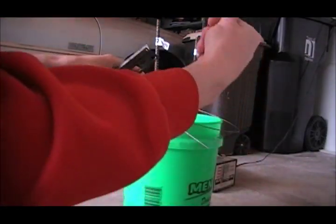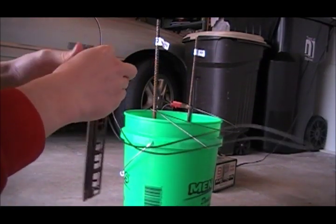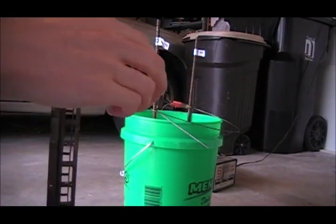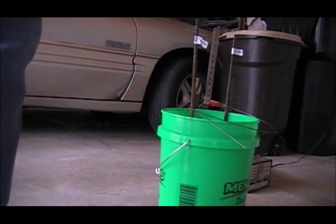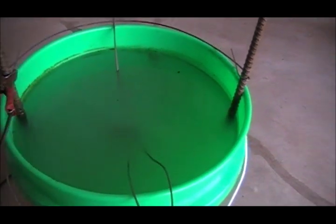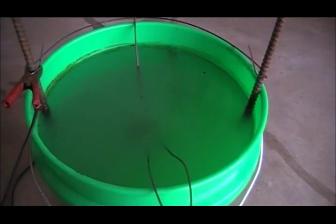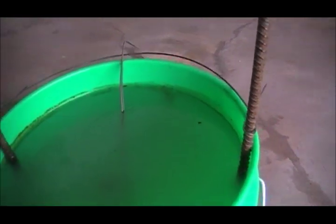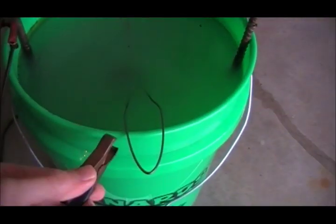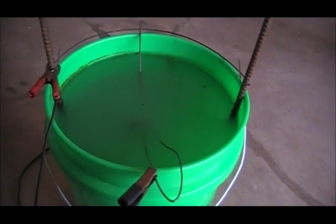I have this piece of piano wire which I've formed as a hanger. Just stick that through the window and it'll hang in there nice and tight. This will go right into the bucket between the two electrodes. Once it's hanging in the bucket, make sure it's right between the two electrodes — that's apparently the best point for the process to work. Also make sure none of the wiring is touching; I don't want any short circuits. The black connector will go right there, and then we can plug in the battery charger.